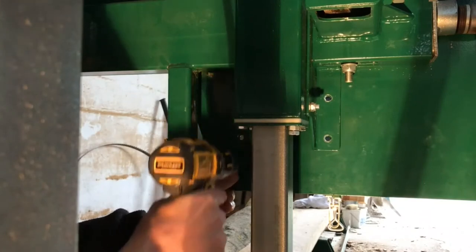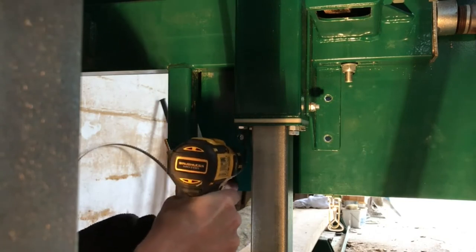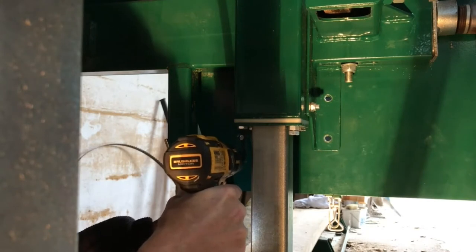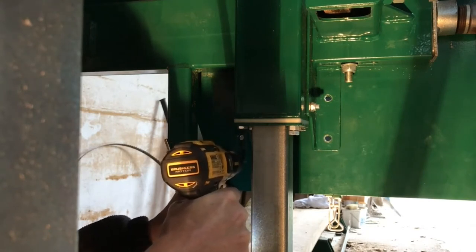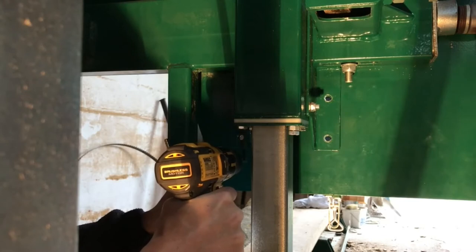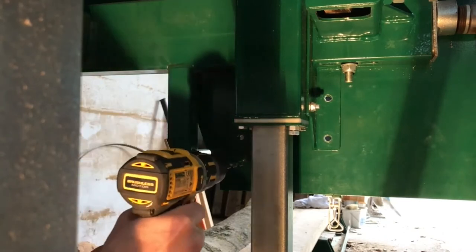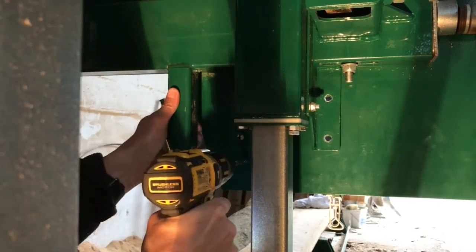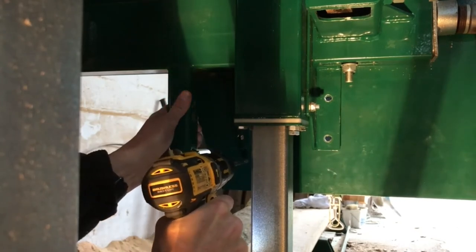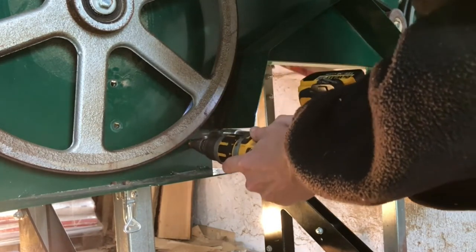And when it has been marked where we have to have this hole, it's just to drill a sufficient size of hole. And I ended up having a hole of, I think, about 19 millimeters, something like that. And that should be sufficient so you have some space so you can both align it in the holes, but you can also twist it a little so you have some space for that. And the reason why is because it actually goes through the back plate here. And as you can see here, I had to use a special drill to get the full size.